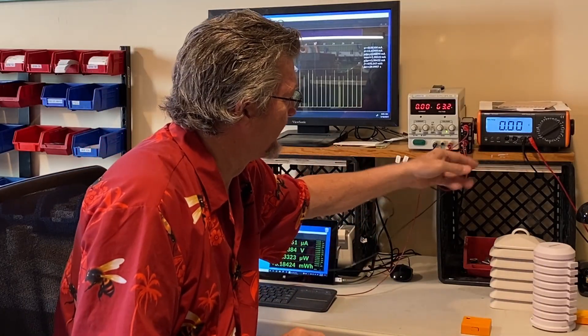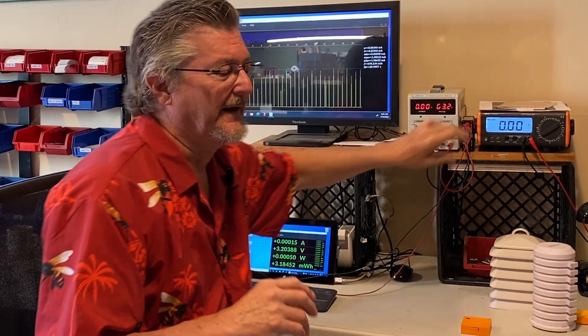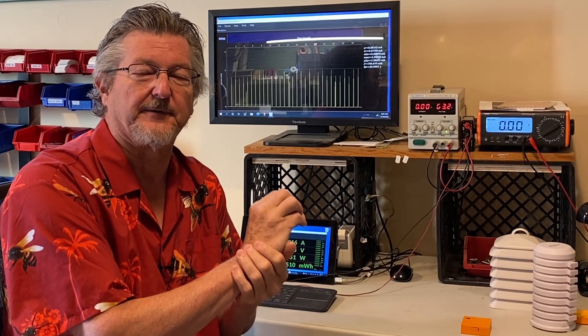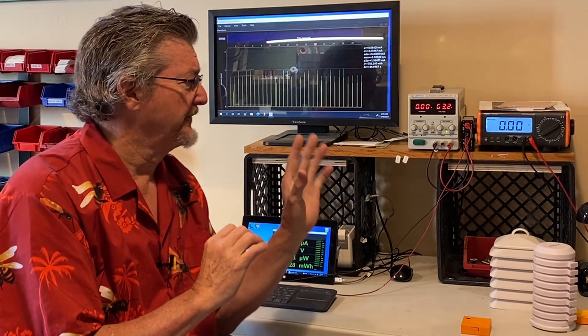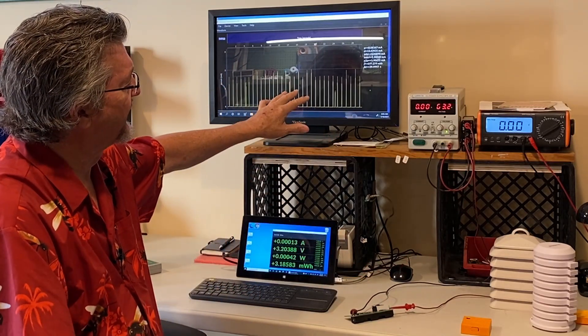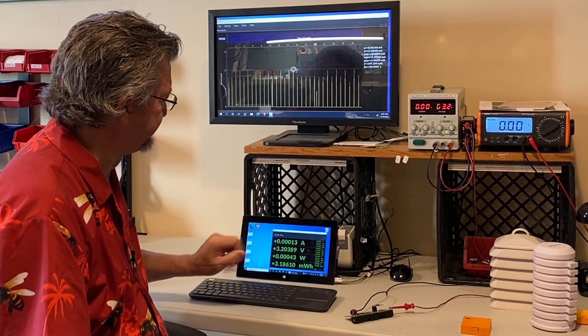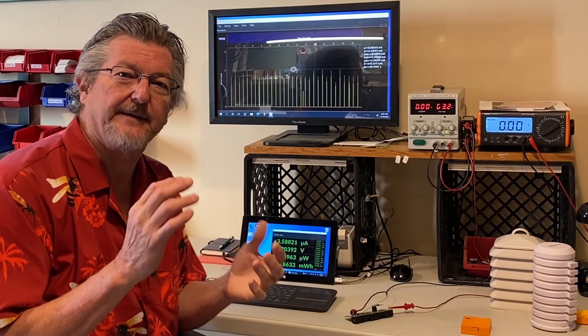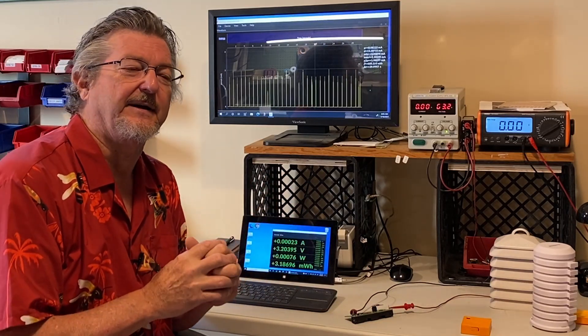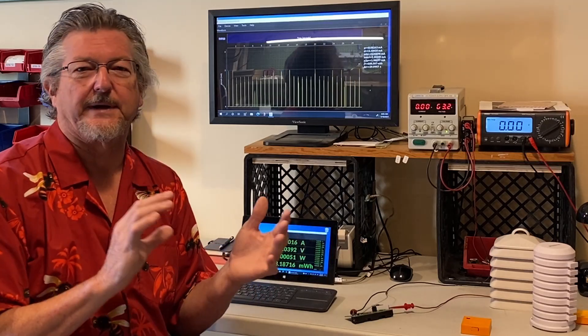Writing that software was really tricky — we'd have to put it in this mode and that mode, combine them and hope we were okay. As a result, we've found it, but it took an awful lot of testing. Last year we got a new device called a Joulescope, which was three or four hundred dollars — compared to the test equipment we would have needed before, which was about $10,000. Now we can see continuously what's going on with the current consumption, leave it run for several days, and measure how many microamp hours or milliamp hours the battery has been used up.